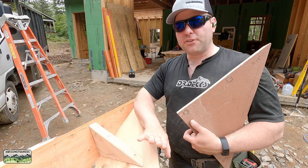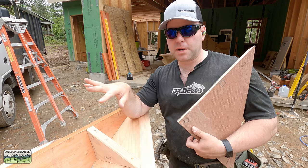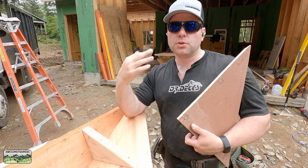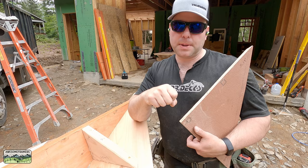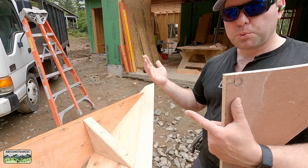To figure out the backing angle for the sleeper: the BuildCalc app will tell you what the 7/12 backing bevel is and the 5/12 backing bevel. Add both those numbers together and subtract from 90 — that's your saw setting. If it was a regular pitched roof you'd just take the backing bevel times two, subtract from 90. That works if you're less than 6/12; otherwise it goes past the capacity on most saws unless you have a swing table. That worked out to be about 52.8 degrees — one cut and you're done.